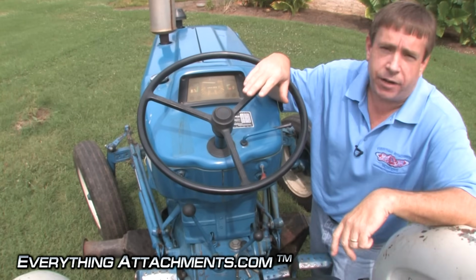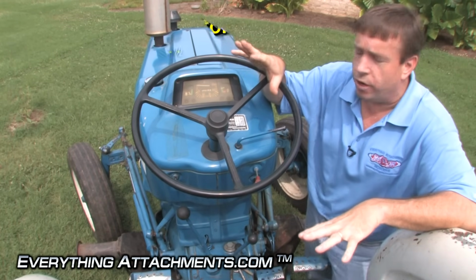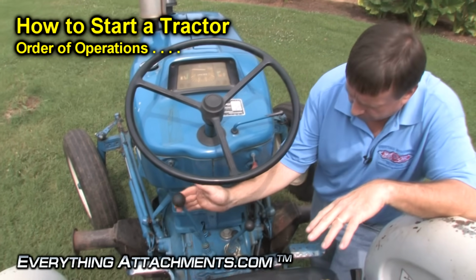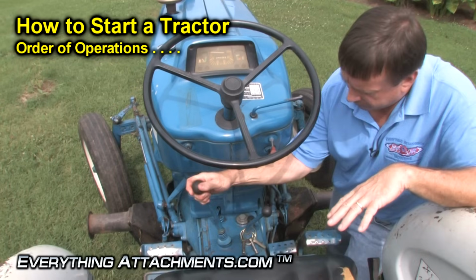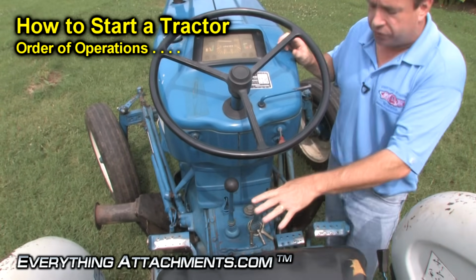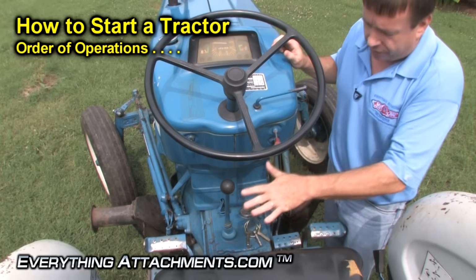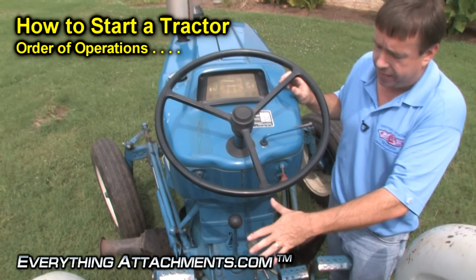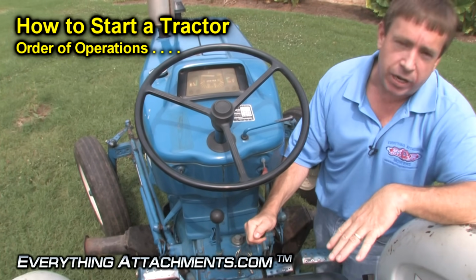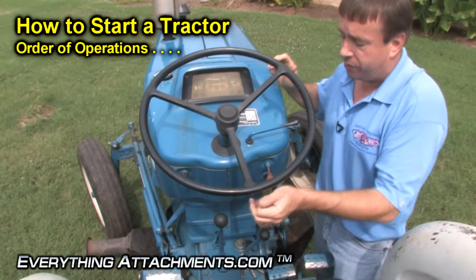Okay, on this Ford tractor, we're going to show you how you would do a general startup procedure for a diesel. Most tractors are going to be the same. On this particular tractor, it has an 8-speed transmission. This is your main gears over here, and this is your high and low range. Your high and low range has to be in neutral to crank, and if you've got an older Ford and it won't crank sometimes, you may have to wiggle this lever just a little bit to catch that safety switch.